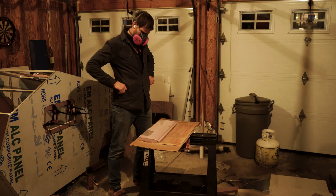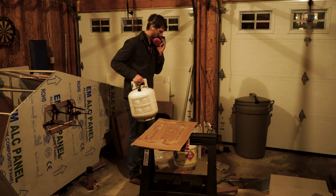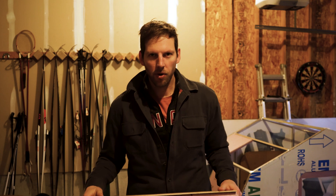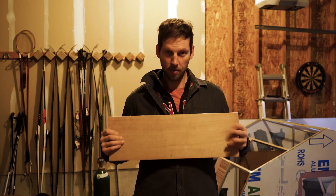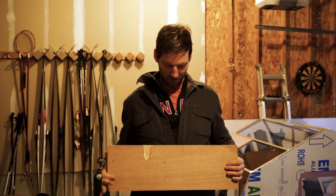This sandwiched composite material is composed of two layers of quarter-inch plywood with three-quarter-inch rigid foam in between. I'm really hoping it's gonna be strong enough to use for my floor instead of the coroplast. Okay, it's the next morning — let's see how it feels. Oh, that feels pretty rigid.